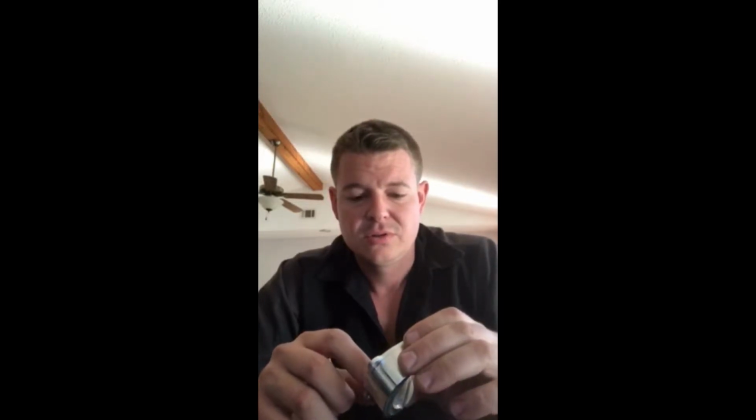And what I realized is this distance from here to where I'm cutting, which is the bottom of that, is 0.82 or something, and the length of cut on my end mill is 0.75. So one thought I had was just to use the 2 flute I've been using. It should cut it. Just have to go slow.